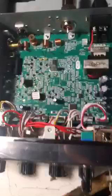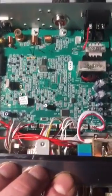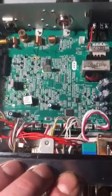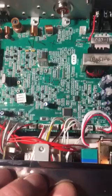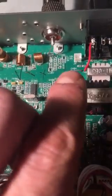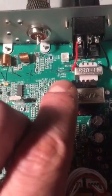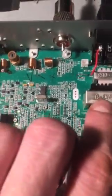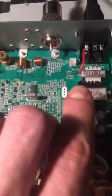Basically what I found with this thing: the AMC doesn't work the same way it did in the old Cobra 25s and regular 68s. Rather than dick around with that, I just kind of left it alone. I put a jumper on and removed the diode that connects the secondary of the mod transformer to the collectors of the finals, and jumpered it.